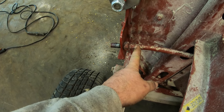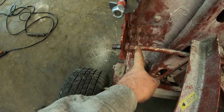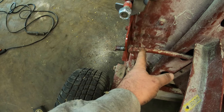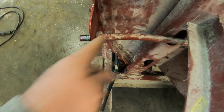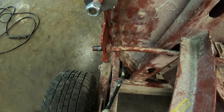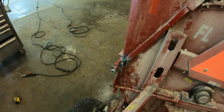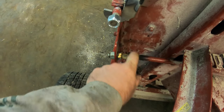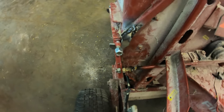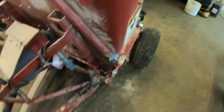Next step — at least do this and then it'll be as good as it was before we broke it. I had asked for these parts but not sure what happened there. I'm going to cut this off here and get a bolt — I believe it's a 5/8 size stud — and weld that bolt on here. I was thinking of just cutting the head off, but I think I might actually use the head to weld on — it'll give me a little more surface to weld on. I put a bolt in here and welded it on. Did the same thing over here.